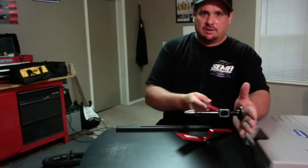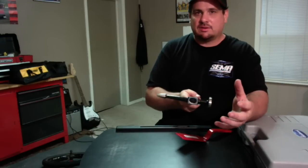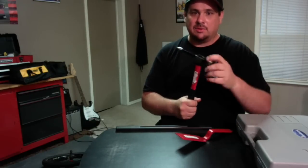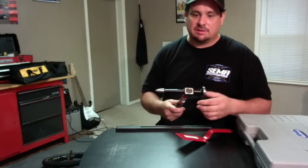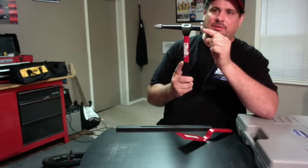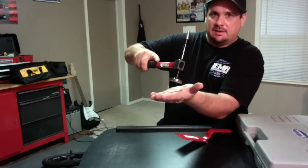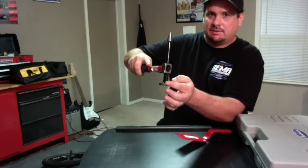You don't want to be framing a house or anything — it's gonna take a series of smaller strikes rather than big ones. When you're hitting a nail you want to hit as hard as you can, but that's not the case in body work. You want to use a series of smaller strikes. This is a flat surface but it's slightly rounded on the edges, because if we hit off-center just a little bit and that edge is real sharp, you're gonna dent the metal. Most of your body hammers are slightly rounded on this edge.